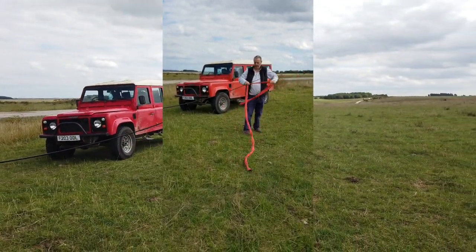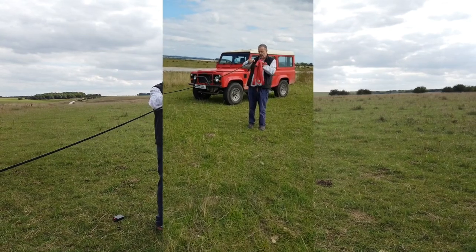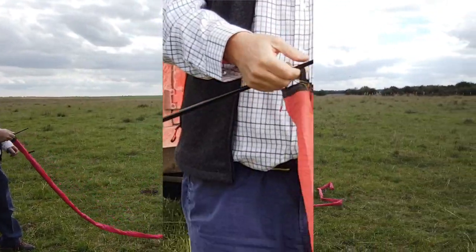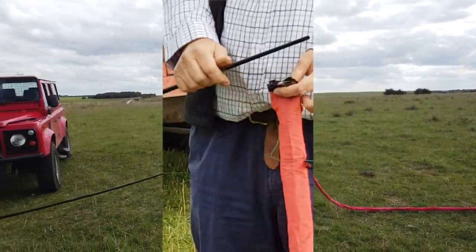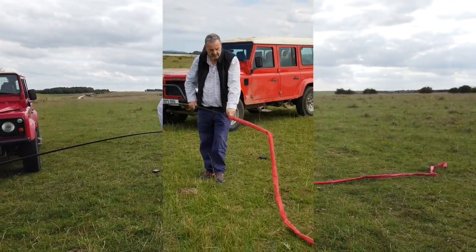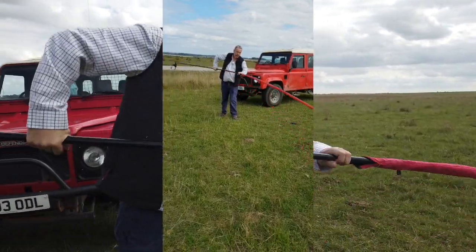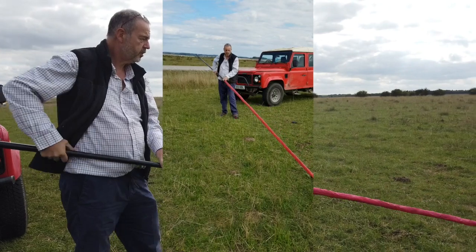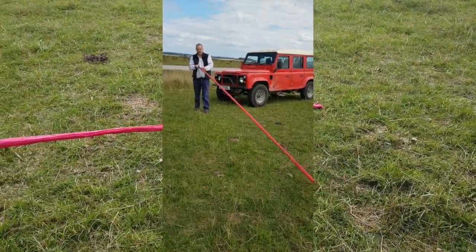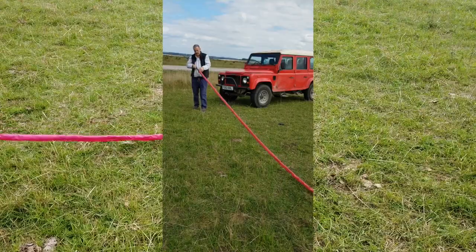Get your sleeve antenna — you can see how easy it is to carry, very little to it and very lightweight. There's the feed wire at one end and a loop to help pull it on. Throw the rest of it out in a straight line away from the mast, so you have a nice long straight run of mast and antenna. Slide the antenna onto the mast, holding the tip and gently pulling it on using the little loop. Keep that run as straight as possible — it's a nylon sleeve so treat it with a little care. It starts to feel a bit tight on the mast, but that's normal; it's made on this mast.